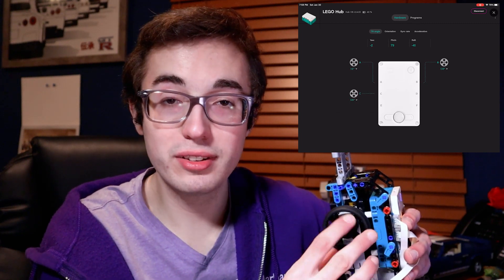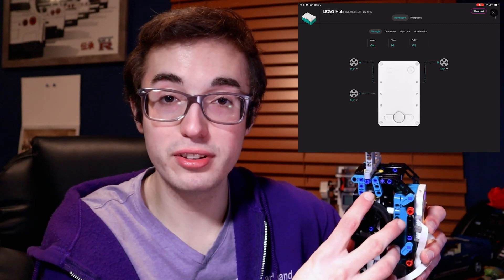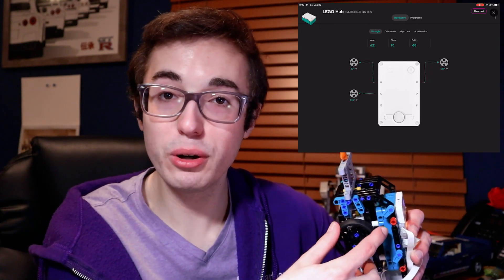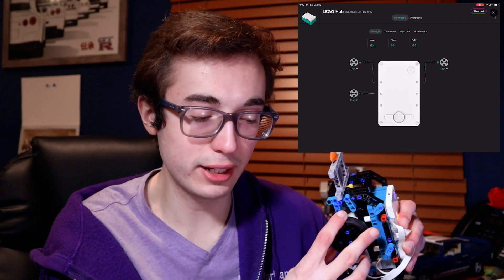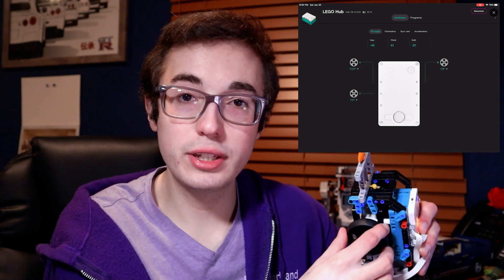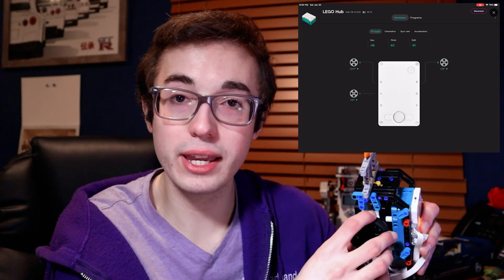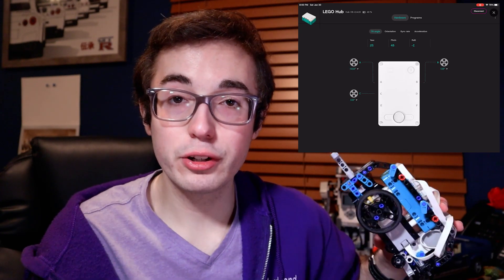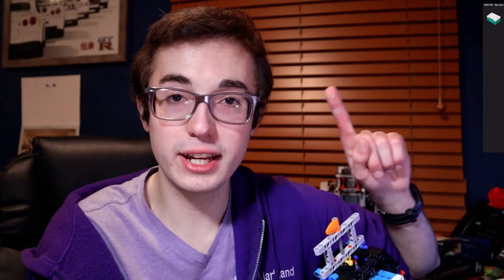You can also click on relative position. When you select relative position, the encoder measures motor position relative to wherever it first started, called the zero degree position. This is most similar to what we had back in the EV3 — it integrates the motor's position over time to give you the total accumulated angle, so if you keep turning the motor it'll keep going and going. If you're going to use odometry as a strategy for your FLL robot to measure distances, I recommend checking out that older video which covers those techniques.